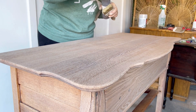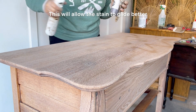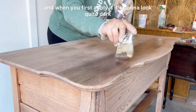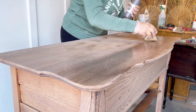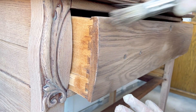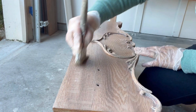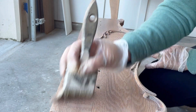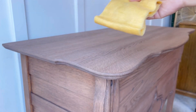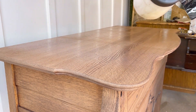I just made a last-minute decision to add a little bit of warmth to the finish with Mudslide from Lillium Paint. I'm going to mist my surface first — this will allow the stain to glide better and gives me more workability. It adds a little bit of warmth, and when you first apply it, it's going to look quite dark, but as the stain dries its color will get lighter. When you apply a darker finish over a lighter one this creates more depth, and I just love when that happens. The stain goes into the grooves and it just highlights the look — it's so beautiful. With the piece almost done, I'm wiping down the sideboard with a tack cloth to make sure there is no dust, then I apply three coats of top coat to protect the new finish.